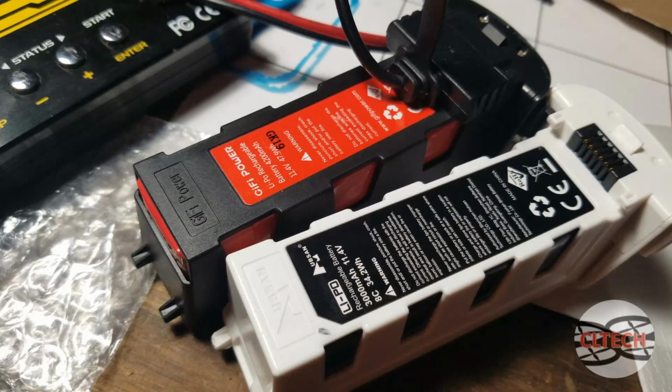And I know if you update the app, you'll get battery warnings, and maybe at some point that battery warning switches into an automatic shut off and is causing the drones to fall out the sky. Because I only had the 4200 milliamp battery fall out of the sky once I upgraded the firmware to the latest firmware. Now, when I went ahead and downgraded, I have not had issues since. So for me, I'm saying I believe that it is the firmware that's the problem and not the battery itself. But again, the battery percentage is not reliable using the red battery because the Zino's not programmed to recognize that 4200 milliamps.